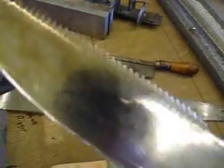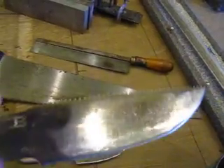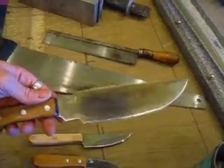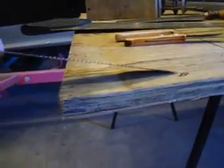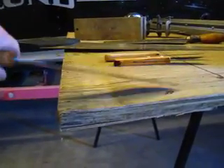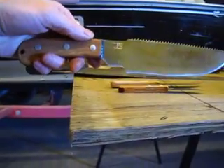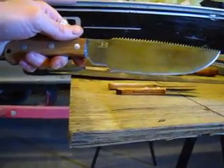Here are some examples. With saw blades or files, you can leave a bit of the texture from the saw or file on the knife to give it some character. Here's a great big blade made out of one of these super thin saw blades, which makes an excellent slicer. You can temper it to a spring temper or really hard — this is done at about 400 degrees.